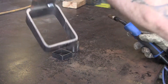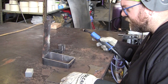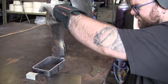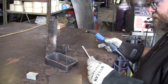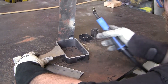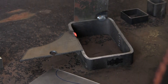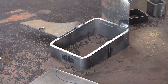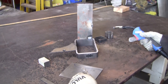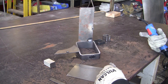Picking up the sheet metal sooner. I think I got the voltage and the wire speed pretty much dialed in for that. Didn't burn through the sheet — we got full penetration through the sheet metal. It's nice and solid. Now, if you can use a hot glue gun, you could totally MIG. Beautiful. I only had about half the wall thickness there, but I think it's pretty good.